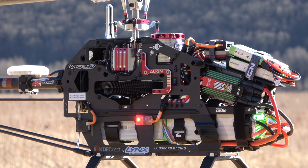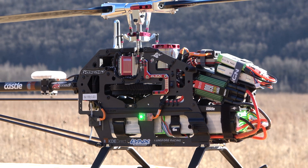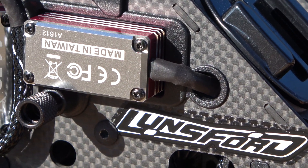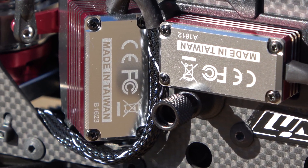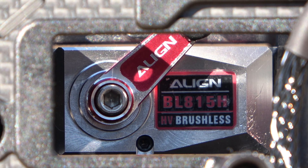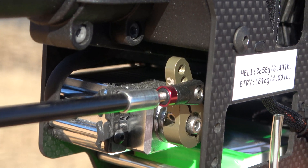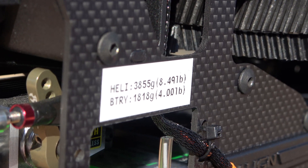On the right side is a super bright LED I can see from the ground to indicate health status of the avionics. Green means it's initializing, blue means it has a good satellite lock, green-blue flashing means it's under GPS control, and red means there's a problem or too much vibration. I was lucky to get bonafide stock Align serialized servos. They're capable of running high voltage, but I run them at 7.3 volts. The swash is a BL815 and the tail is a BL855. The tail horn is an axial CNC cut horn I found on Amazon — much more burly than the plastic horns that come with the Align kit, and it just looks a lot better.